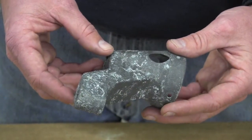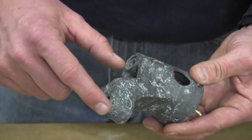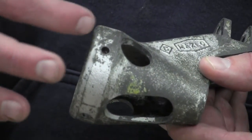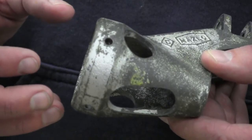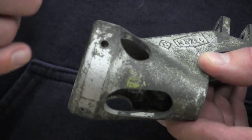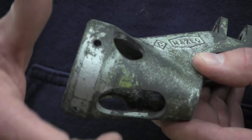On this particular torque arm fitting off of a Beechcraft Baron elevator, the corrosion is especially bad. You can see the white pitting areas here. Around the edge, you can actually see missing material — chunks of material actually gone from the edge of the torque arm. The most common area for cracking on these torque arms is from the bolt hole to the edge of the torque arm. There are four screws that fasten the torque arm to the elevator structure. If any of those fasteners are over-torqued, there's a tendency for cracks to start from the bolt hole progressing out to the edge of the torque arm. Another common area for cracks to occur is between the access holes on the torque arm itself, the crack propagating from one hole over to another hole. Once the magnesium torque arm is removed and replaced with an aluminum torque arm, the repetitive inspection is no longer required.